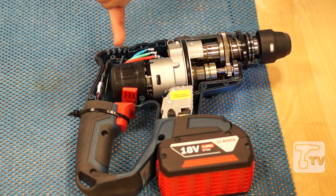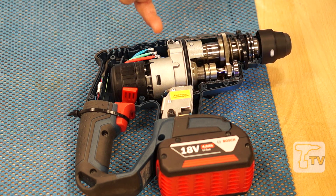How it works: the coils which are normally on the armature in a conventional motor are now on the outside. They're around the motor and the armature has no windings, no electrical connections — simply permanent magnets. So it's basically a rotating magnet within electronically switched coils around the outside of the motor.